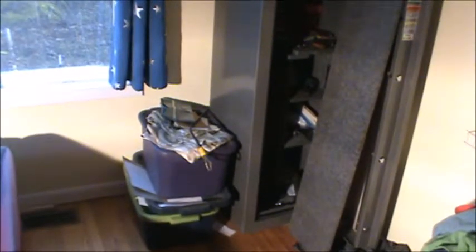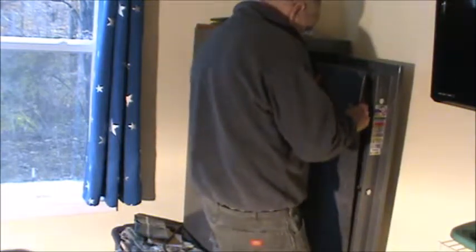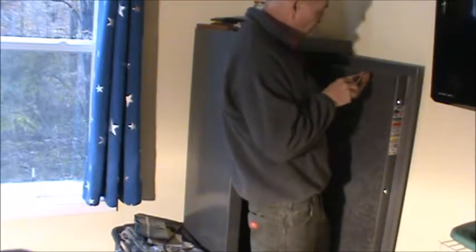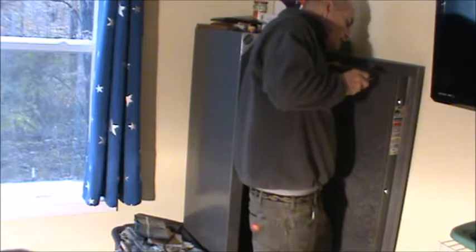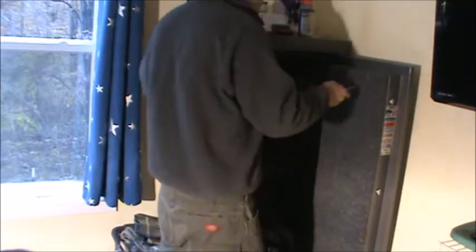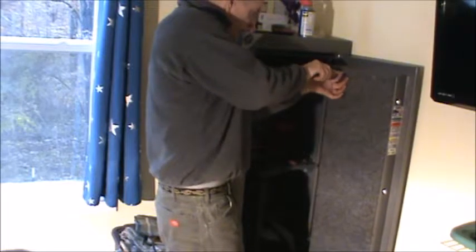Save yourself some money. I'm not sure if any of these safes are any good — you might be better off just getting a metal cabinet. Even though they're big and heavy, I'm just not sure if the actual security you get is even really there. And just like this panel here, I may be catching one, one-and-a-half threads — that's just not enough. They should be using a longer screw than that.